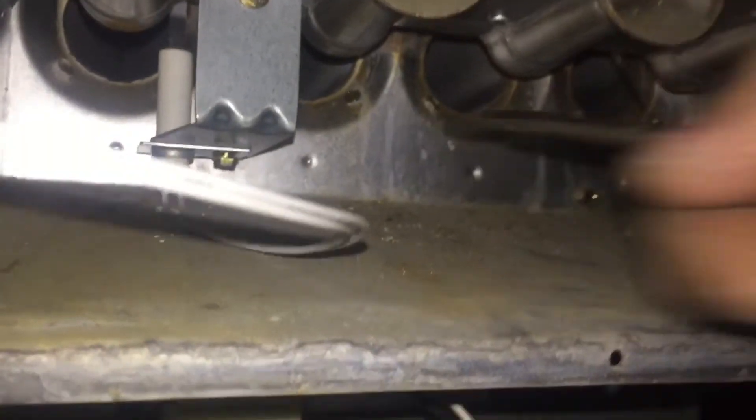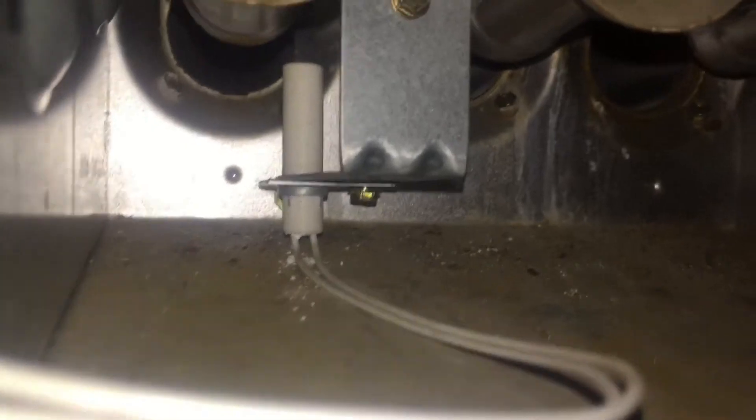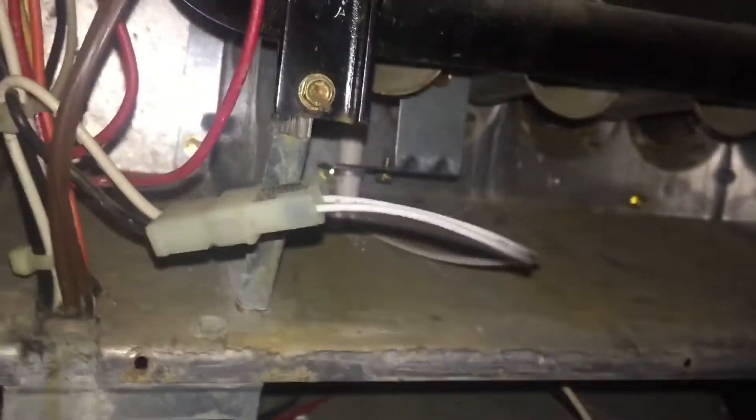One more thing I forgot to mention: the igniter coil. If you follow these two wires up underneath, you'll see a flat hot-surface igniter coil — those fail quite frequently but are easy to change. Test it with your ohm meter on the ohm scale, and put the meter across the two terminals. I believe the spec is around 40 to 90 ohms — you'll need to look up the exact rating for your unit. They're not too expensive: about $16 to $17 online, maybe $30 to $40 at your local store. Anytime you have a furnace technician come out it's an $80 service call plus labor and double or triple the parts price, so you can save close to $100 doing it yourself.